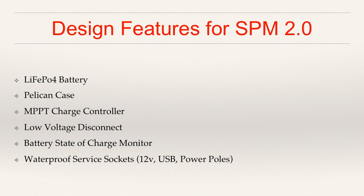I definitely want to stay with a maximum power point tracking charge controller, which I had in the previous box, but I want to make sure the new one is RF quiet. I also want the battery protected by including some type of alarm or low voltage disconnect — a device that ensures the load is removed from the battery if the voltage gets too low. I want a true state of charge monitor capable of Coulomb counting, something that acts more like a gas gauge. And finally, I want waterproof or water-resistant service sockets for 12-volt cigarette lighter, USB, and Anderson power poles.